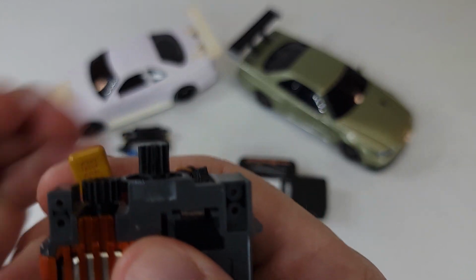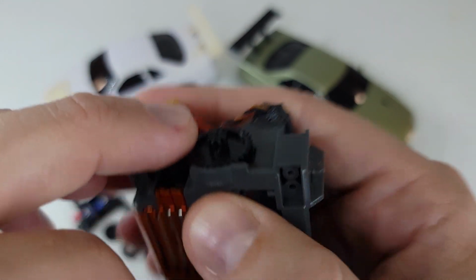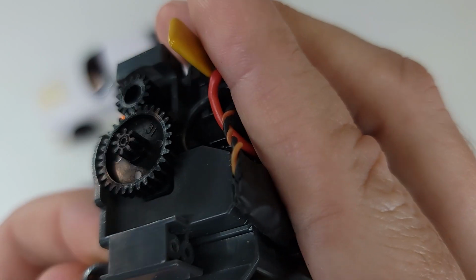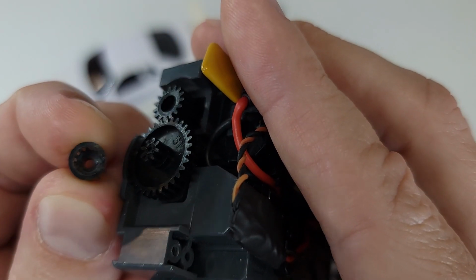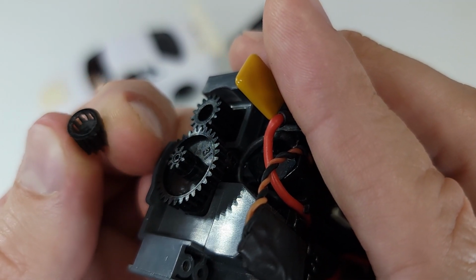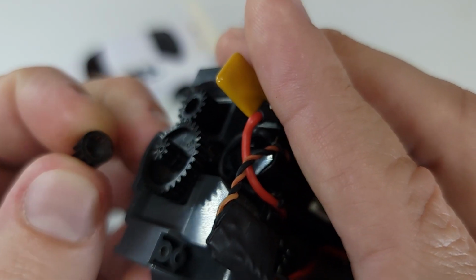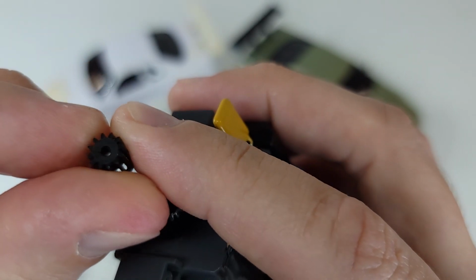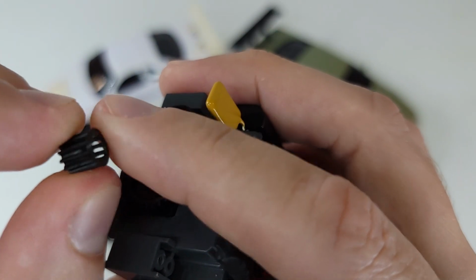And this one, like I was saying, I did a different approach, to where I left the 8 teeth on there, and then I drilled out a 5 millimeter hole out of this gear, and it had to be absolutely perfect. And you can tell there's barely any material to cut out a 5 millimeter hole on this thing, because it was already too small. I wouldn't be able to do that with the 10 gear. I can barely get away with it. The 12 tooth, the 10 tooth wouldn't be able to do this.